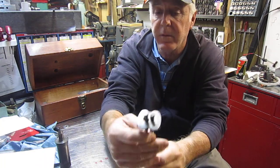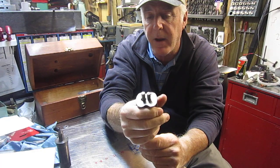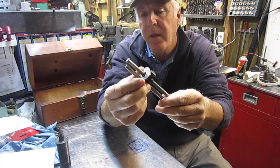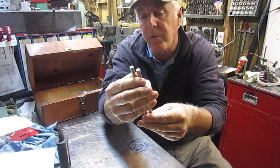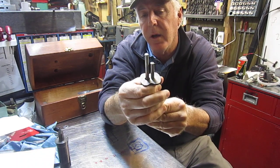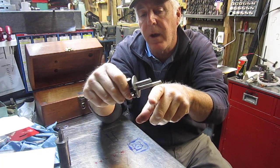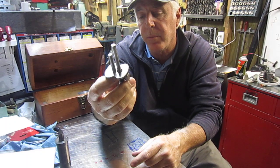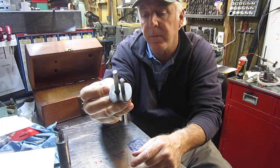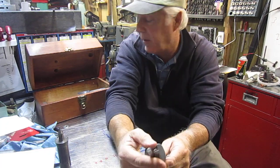Another item of tooling interest. These are scribers — there's two of them — and they're dimensioned on the side. I think these are primarily used in the sheet metal or metal trade, because you can set two different heights. You can scribe on one side, then flip and scribe on the other, making the tool multi-purpose. It was relatively inexpensive and it's been a useful little tool.